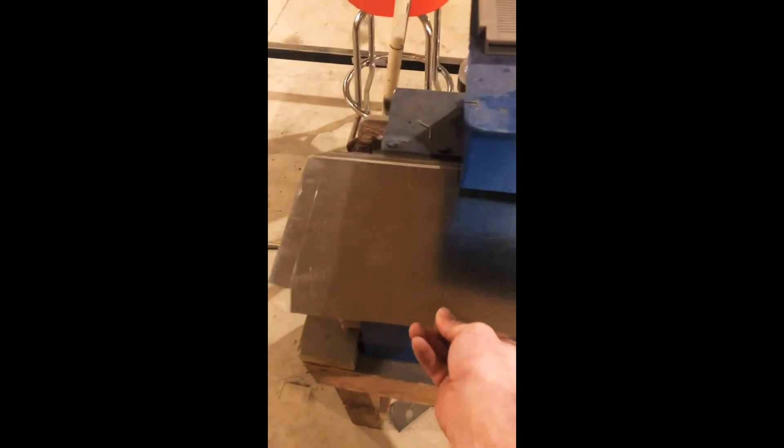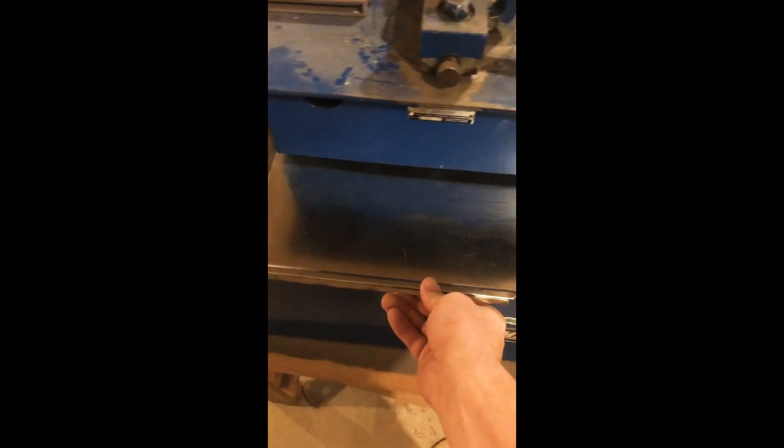Here's what our piece of steel looks like now. Let's turn this Pittsburgh machine on. Make sure we do the right side first. The purpose of this Pittsburgh seam is that the quarter inch will fit right in there — you fold that over with the hammer and it locks right in.